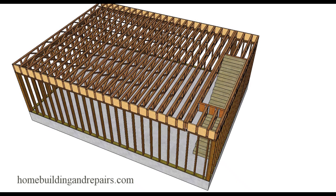You might even be able to use a 6x14 here. Find out what size beam you need - get a glulam or something like that - and then the rest of the floor you'll use trusses. This section right here will be conventionally framed with 2x14 and maybe a glulam beam, micro-lam, or LVL beam. Something like that.